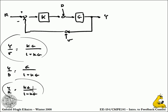Well, so now the question is, what do I want to do? I can reason and say, well, wait a minute. I'm going to work very hard at the frequencies at which I am concerned. I am probably not going to track this. I'm not going to want my system to track at as high a frequency as the noise is going to be bothersome on. In other words, I can work pretty hard at making this fairly good at DC, all right? But it's going to have some high frequency noise on it, right? Because as I'm trying to get my sensor to track to give me data faster and faster, it's going to have some issues. All real implementable sensors will start breaking down at higher frequencies.